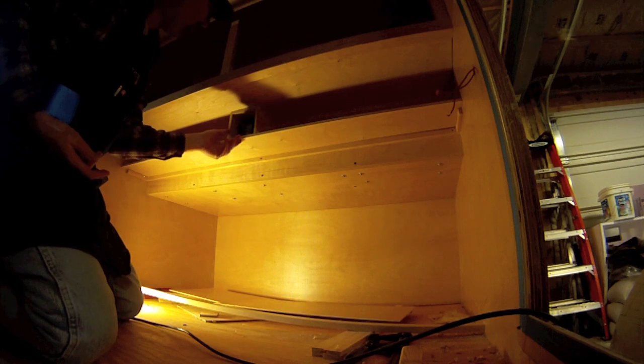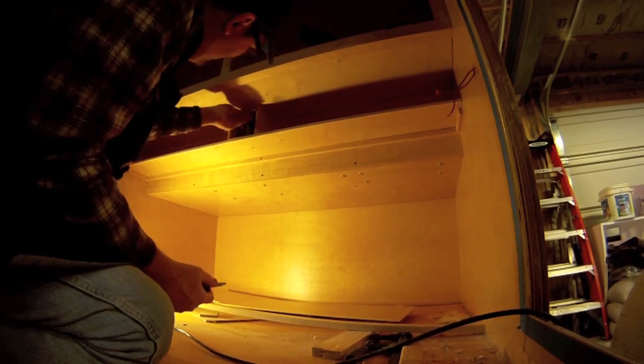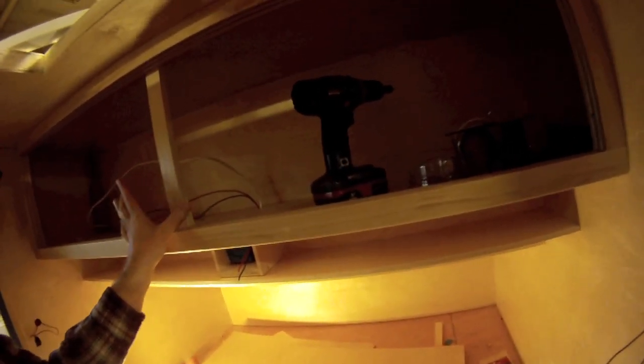And then I punch some holes here in the top. I'm going to go ahead and run my drill bit with my countersink and put some screws in. So that's in there good and tight. I'll put in the rest of the screws. Looks like from the top. And so those will be fine, because remember those doors, being sliding doors, they don't completely open, so you'll never see this part in the center.